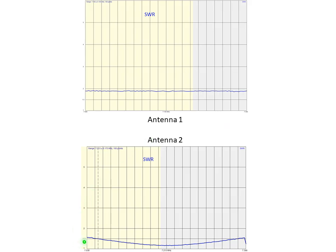And then when we look at the Hextenna, it's running a little bit lower in SWR, which is better, starting here at the low end of the band, just above 1.5, comes down to about a 1.3 or 4 at the minimum, and then continues upwards to just a little bit over 1.5. So you can see how you can easily tune this antenna to get the resonant point, which is right here, exactly where you want it, about in the midpoint of the single sideband section of 40 meters.